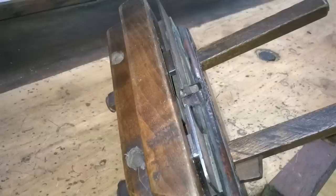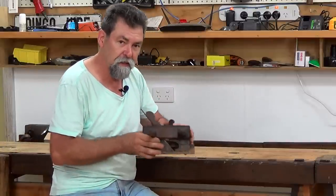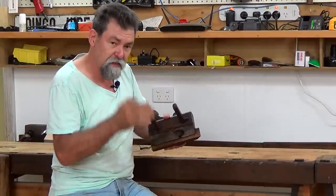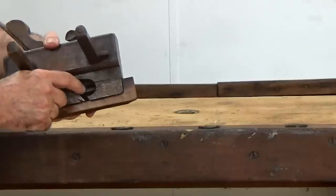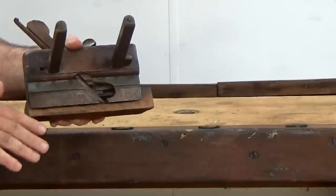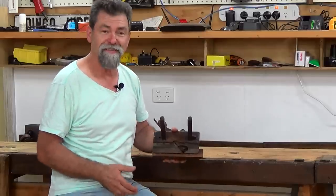That steel body — it's a foot. So as I'm pushing the plane through and cutting and cutting and cutting, it'll get to a point where the blade is down in the slot far enough that the foot will start riding on the top of the piece of timber I'm planing, and won't let the slot get any deeper. It's brilliant, isn't it? So clever.